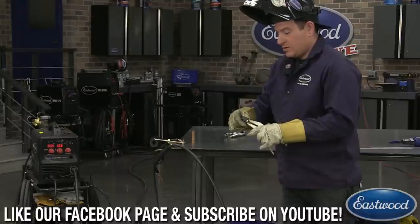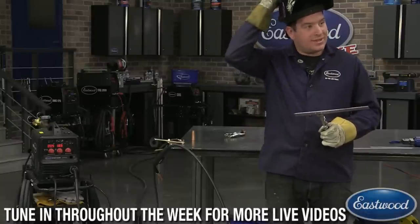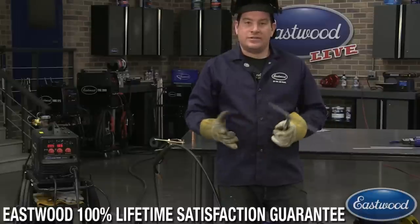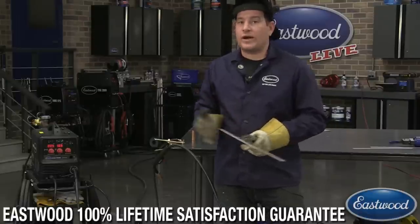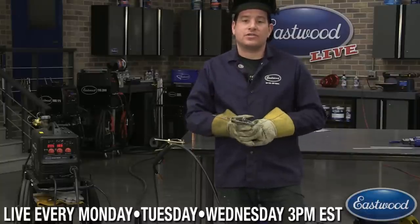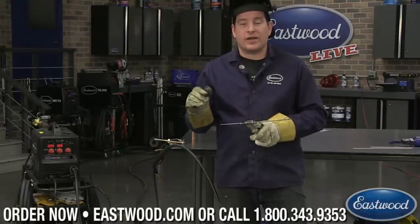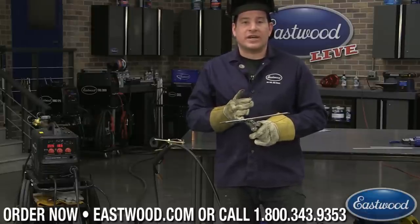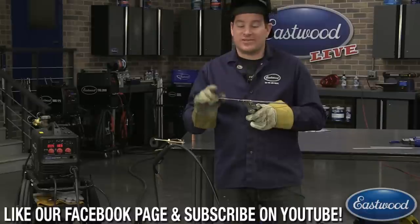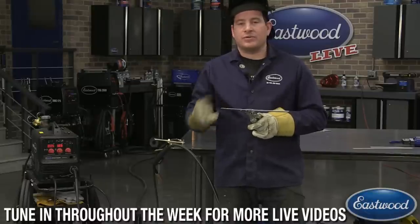Do you have any questions coming up? Andrew has asked if you can also spot weld the way you're doing with flux core wire. Yeah, that's a good question — you can do the same spot welding process with flux core wire, you don't necessarily need gas. The only thing to keep in mind is that it adds some additional spatter from the flux core process, and it's a little more difficult to weld thinner metals like this. But if you're able to dial your machine in just right you can do it — it just takes a little more finesse because the wire is thicker and takes more heat to burn off.